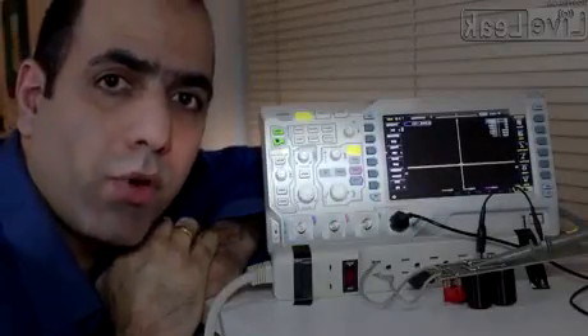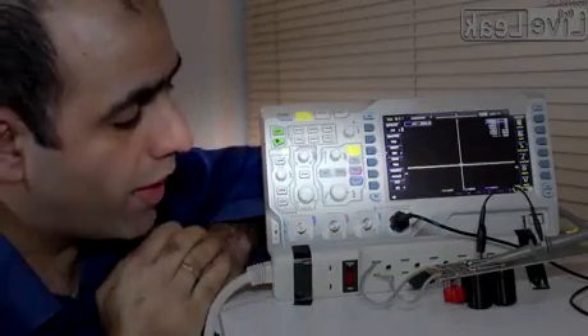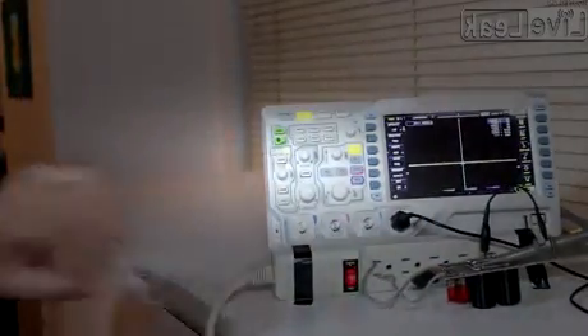Now I will measure some waveforms. I connected the probe to my output lines, connected my circuit to this power bar, and turned the power bar on. My fuse just blew up. Something I realized the hard way is that the ground of the probe is actually shorted to the earth of the power plug through the scope. So what happens is that when I connect the ground to the negative output of the bridge, it shorts the live wire to earth every negative cycle of the AC. And that's why we have fuses — to avoid exciting fires.